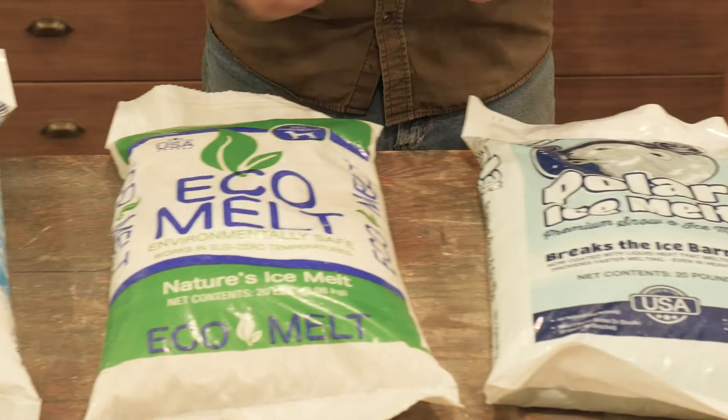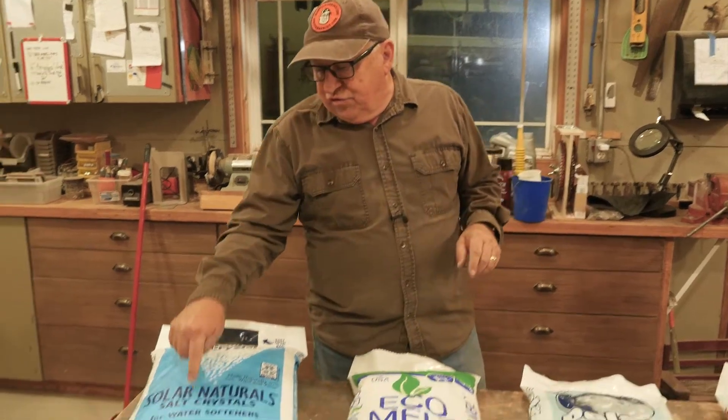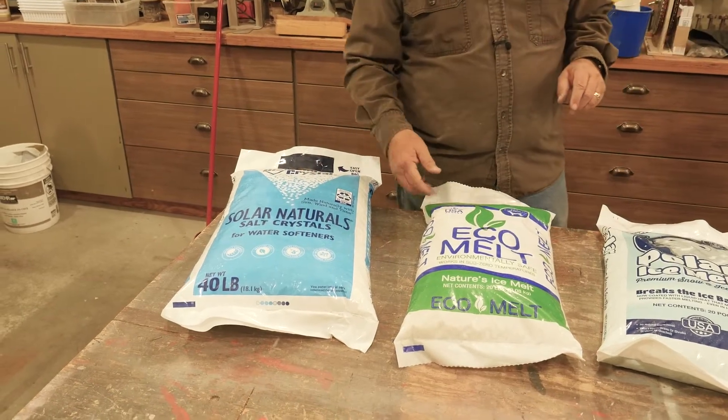Now let's go back over this and explain what you're trying to accomplish. It's all in the brine. What's brine? Salty water. If you create salty water, it freezes at a much lower temperature than standard water does. The optimum time to apply is before snowfall really starts to hit. Then as snow starts to land on the brine surface where some of this is applied, it'll immediately keep melting off because of that salty water film, ensuring there's no bond between the snow, ice, and the concrete, asphalt, or whatever you're trying to protect. As snow falls heavier, you have to apply more, but getting ahead of it is always key. Salt kernels like rock salt will work, but you tend to have to put more product on.